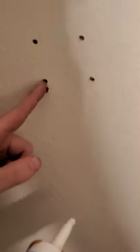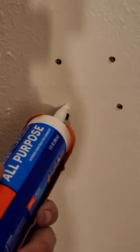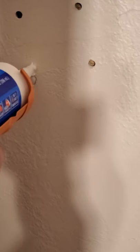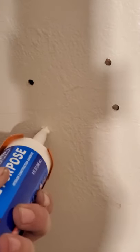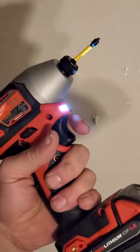Alright, so we got another one where I kind of doubled up — I almost hit the lath but was a little low on this one. So I'm going to go in this top hole. I'm going to start squeezing in and we'll see it start coming back out and around. And you do this all the way down. We'll go back to the beginning to where we have already got the glue on and grab our handy dandy impact driver.